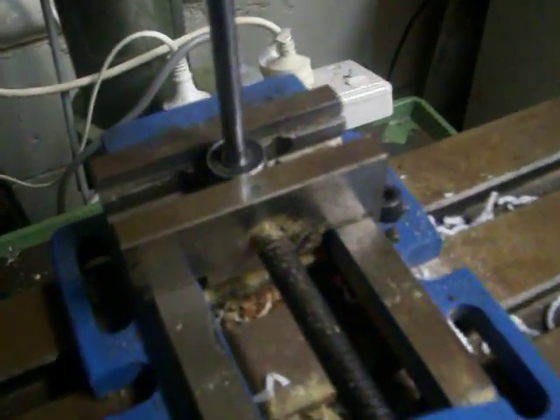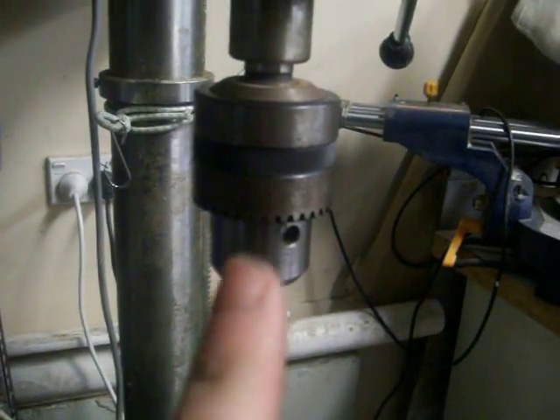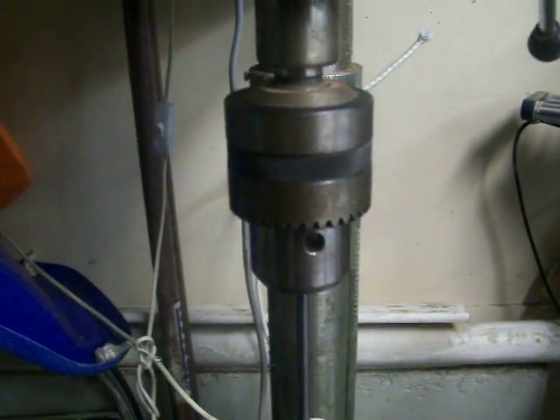The first thing I thought of was to go over to my drill press and stick a bearing in the vise there on the XY table and put the shaft in there and then just run a DTI on the side of it, but there's just so much runout in the quill that I gave up on that idea — I just made them more bent.